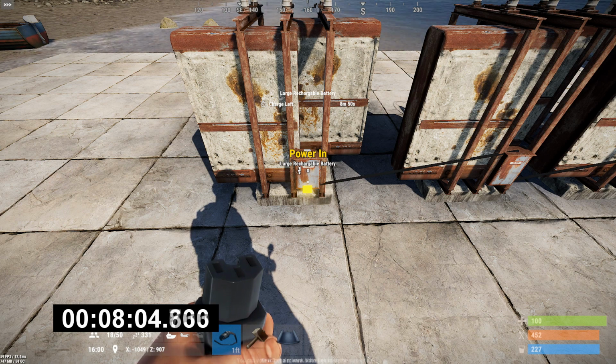That's atrocious. Don't do this. Don't do this. This is stupid. Not only should you be breaking up your loads into different strings and just using like 1 or maybe 2 batteries per string, putting this many batteries together, you'll be waiting for days for these things to charge because they can't charge any faster than this.